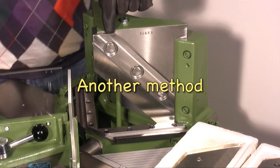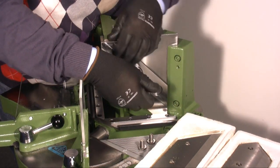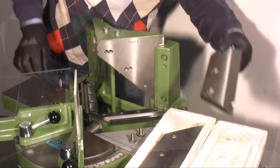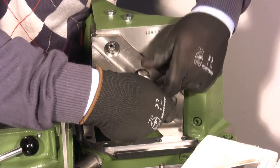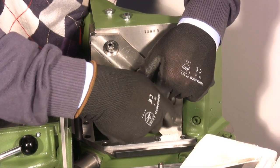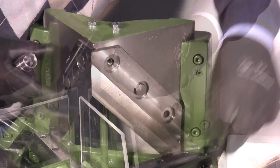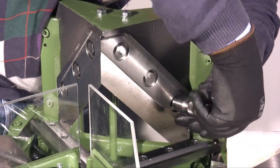There's also another way to change the blade. I remove the first blade. I now change the used blade with the sharpened blade without removing the other blade which is on the other side of the cutting block. I apply the central bolt of the sharpened blade by looking at the position of the other blade which I still haven't removed. I ensure that the point of the sharpened blade coincides exactly with the point of the other blade. I then insert the other bolts without tightening them completely.